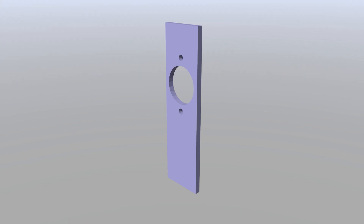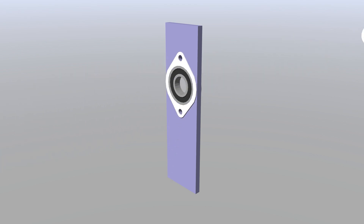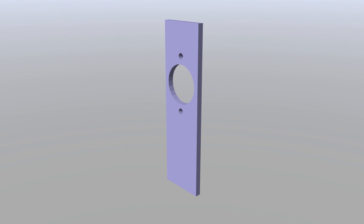The main bearing mounting plate is quarter inch steel. Over that are two aluminum water jet cut brackets that fit the bearing OD. And on top of those are two more water jet cut aluminum brackets that keep the bearing in place. All of that is bolted together. This kept the profile narrow, the cost low, the weight low, and was a quick and easy thing to fabricate.